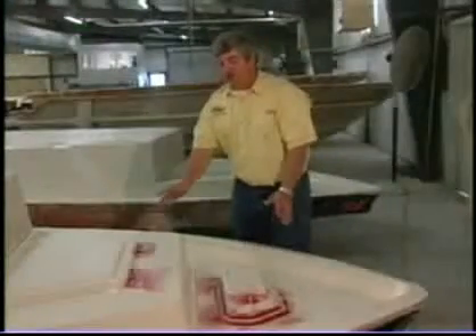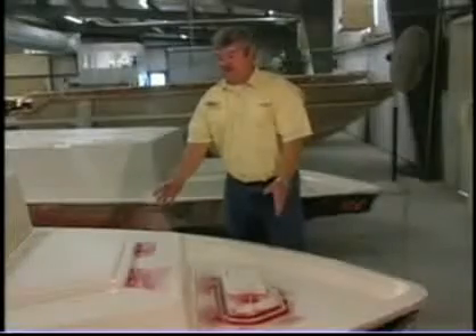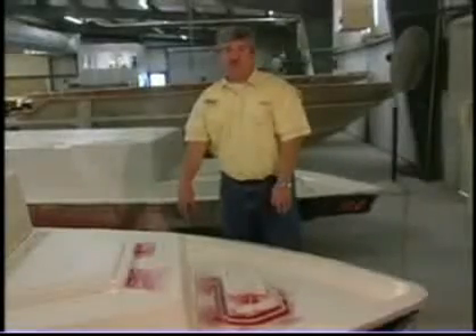This gel coat — this is the side that you don't see. The side against the mold is the surface that you see, but it's only eggshell thick. We want to make sure that the glass gets tight up against this area. We soften these radiuses that are tight — the glass is kind of hard to stay into. It's another step to ensure that 10 years down the road you won't have little blemishes coming back later.